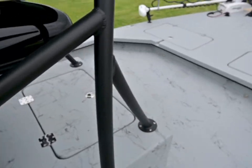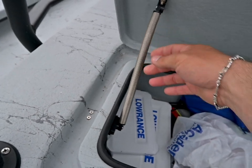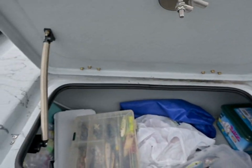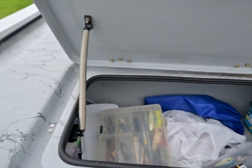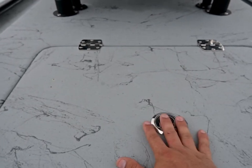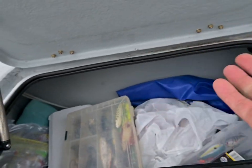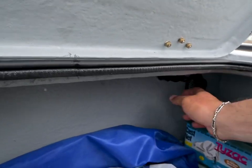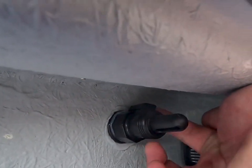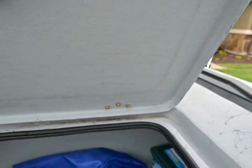Coming to the front: this is another live well I rigged up — also just a storage box right now. I've got screen covers in there along with some bass fishing gear; we've been running around the lake for break-in purposes. It's insulated, so you can use it as an ice chest, live well, or storage. All these boxes run off one pump in the back. There's a valve right here — you open it to allow water in or close it, and it prevents you from having a bunch of separate pumps.